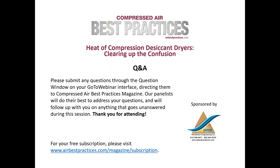Okay. This next question goes to Mr. Henderson, and it comes from an air compressor distributor. The question is, for a negative 20 degree Celsius pressure dew point, what type of desiccant should be used? Activated alumina. You could use silica gel or sorbead, but the standard desiccant that everybody uses in regenerative dryers is simply activated alumina.